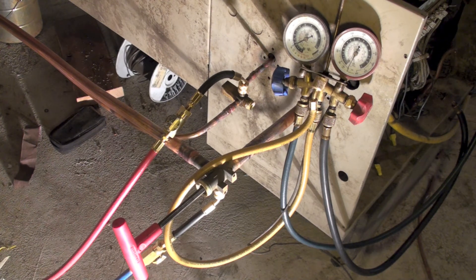That means I have a leak in one of these valves. It's leaking by - not leaking out to atmosphere, but leaking by. So I was looking for a phantom leak, but my leak is actually in the service valves. It's not going to be an effective pressurizing technique if the valve leaks - that's one of the many things that can happen when you're doing this kind of diagnostic work.